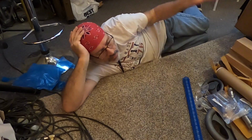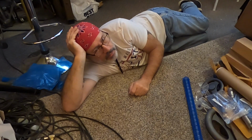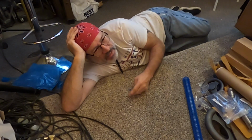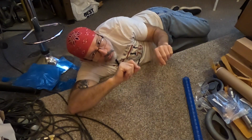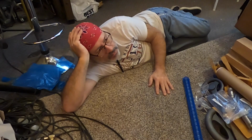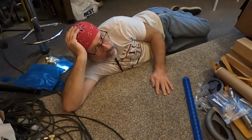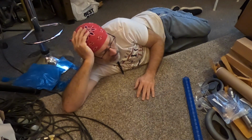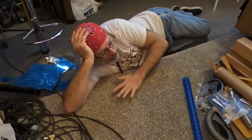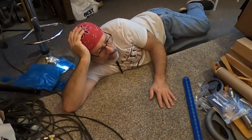And while I've been doing this to all these pieces, every time I'm doing it, I'm like, man, if I had a real woodworking bench, this wouldn't be so difficult. You use the little bench dogs and put them in between there, and you crank down a vise on it, and it stays where it's supposed to stay. You'd probably move the 500-pound bench before you would move the piece out of the vise. And it's completely free around the top, so that you can plane the face down as much as you need to.